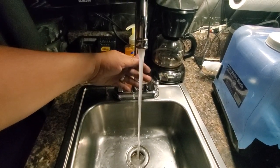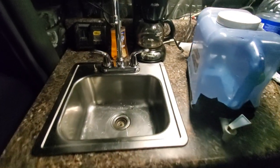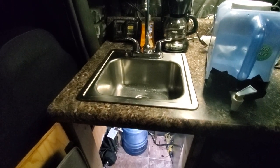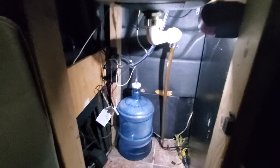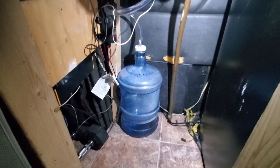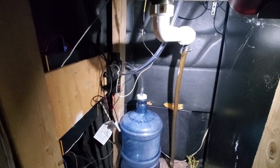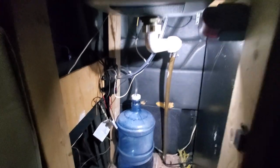Water pump is on, and I have running water. Let's turn the water pump off. The water pump does have a self-priming feature, so if I run out of water and have to get more after the pump's already run dry, it's not a big deal. The pump will also shut off on its own once it reaches so much pressure, and there's actually a screw on top of it that I can adjust the shutoff pressure. So that's pretty awesome.